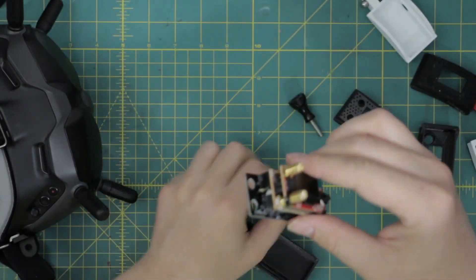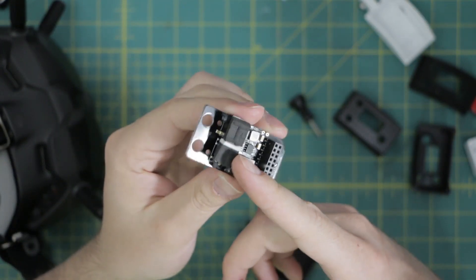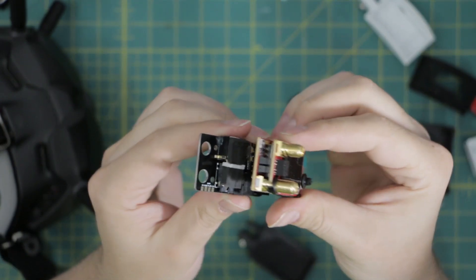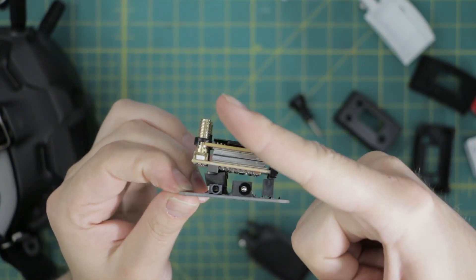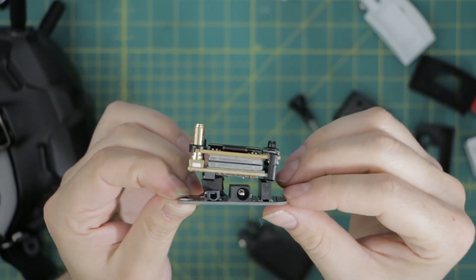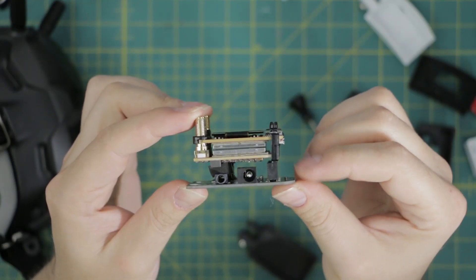You take your stack up here. I have some different sized foam and foam tape — I just kind of experimented to get the best fit on there. You don't want it to be at a super high angle because then when it crushes the foam down you're going to be putting a lot of stress on the components around here. So you just want it to have a little bit of an angle so it squishes down and everything's nice and level.